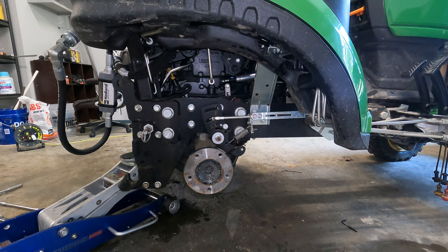When it comes to the backhoe, everything moves more quickly. You can move four functions at once if you use the Hydrus Plus — at least with the high capacity pump or the extreme capacity pump. With the kit alone, you can definitely do two and three pretty easily. Four you can do, but you have to really work at it. I would not say it would allow you to do four easily. The other two pump options definitely will, especially with the highest volume pump — no problem at all.